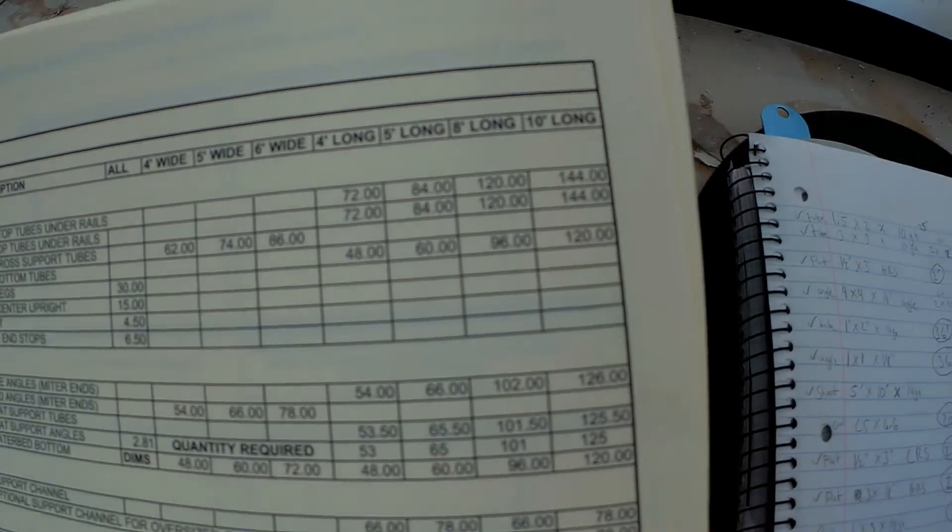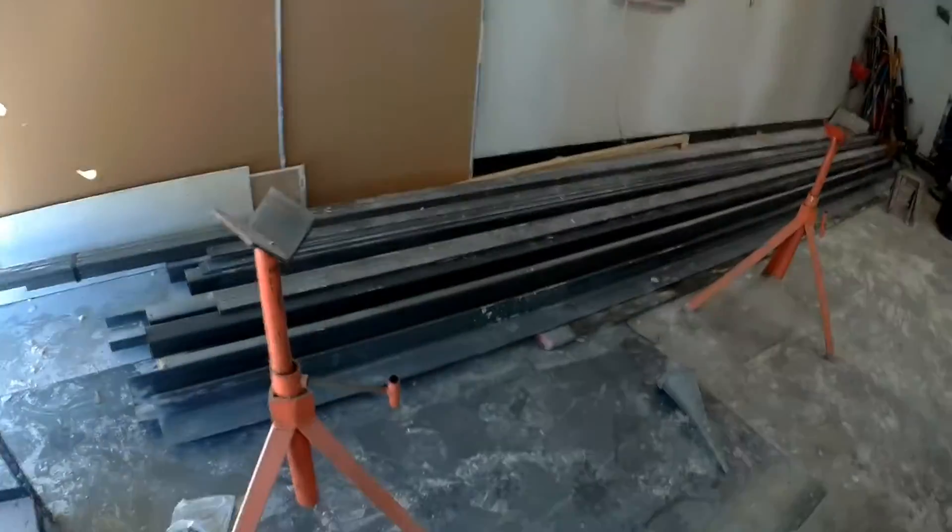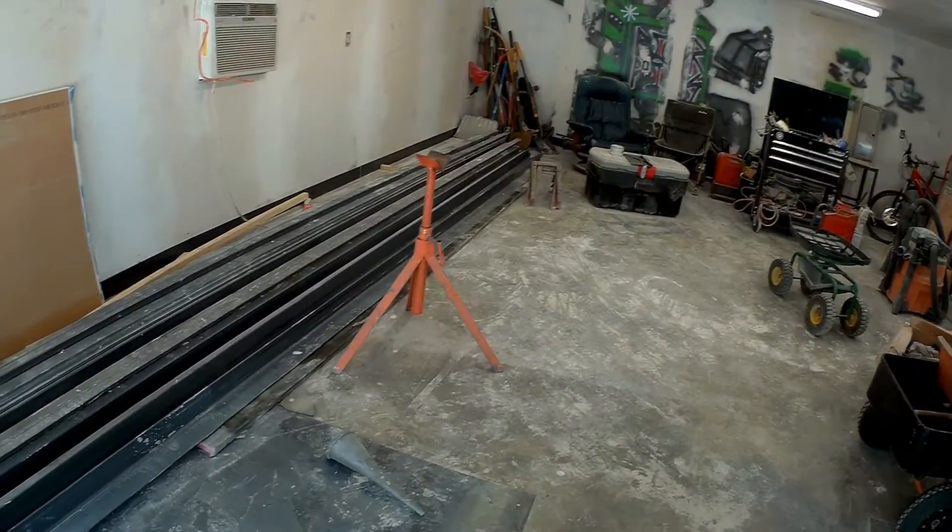I told them what I want: one and a half by two inch, 11 gauge — I went with 10 gauge — by 25 feet. Basically it's called detailing out, because if you hand the original cut list to a steel supplier they're going to go cross-eyed and hand it back to you and tell you to figure out how much you need. Anyway, that detailed list turned into this pile of steel right here on the floor of the shop. We're going to start marking them up and getting the pieces cut so we can weld them.